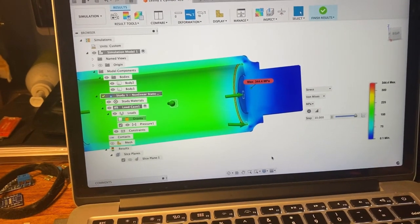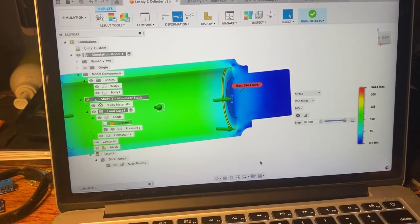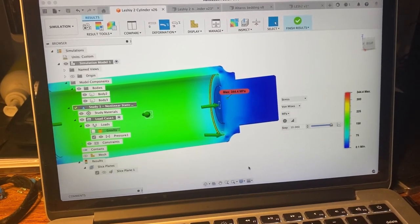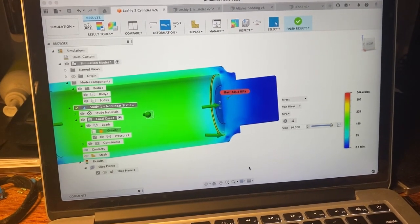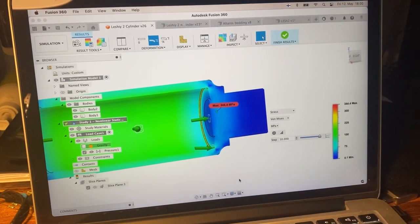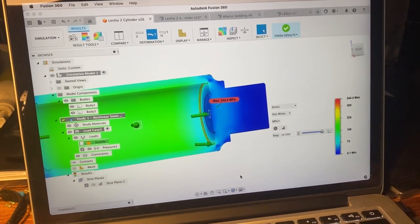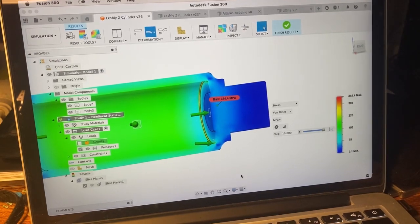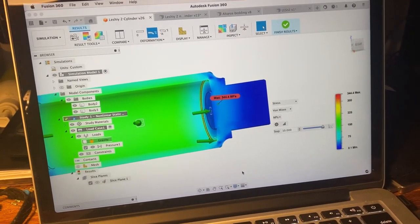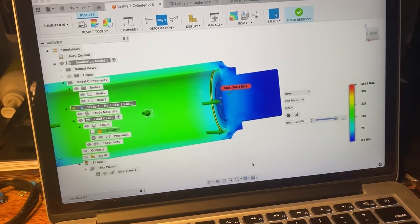And pressure testing, well, I'll make the video about this whole incident, the conclusion of this, as I made a second pressure testing, and I discovered that in the first one on the 470 bar I have made a mistake. Not my mistake, but the mistake in the procedure. There was some debris in the pump, and I believe that has blocked the pressure gauge port that sees the cylinder pressure, and it has been showing lower than the actual pressure in the cylinder, and that's why it was yielding at lower pressure than it should. I believe that is the case, but yeah,